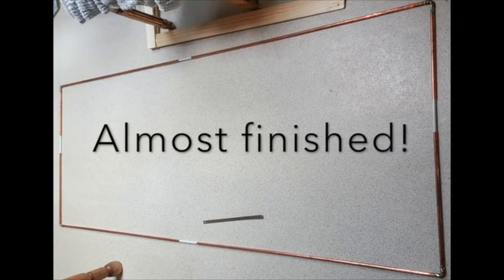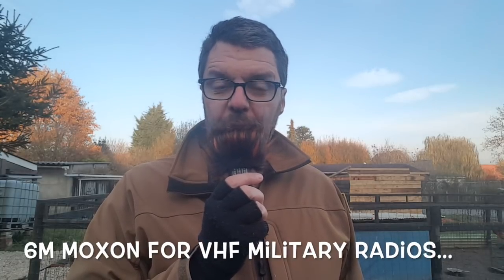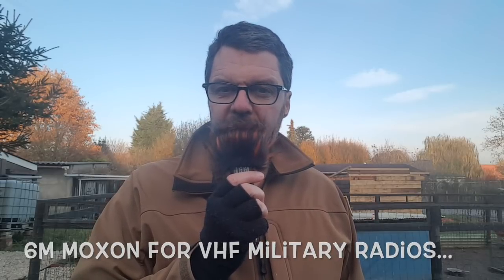If you remember part one, and I put a link down below, I built it out of 10 millimeter copper tubing. It was for the 6 meter band, 51.5 megahertz, so fairly large antenna. And it was kind of wobbly, flimsy. It wasn't really portable, so I decided to build another one, and I had a great idea about this design, so keep watching because it's coming up.